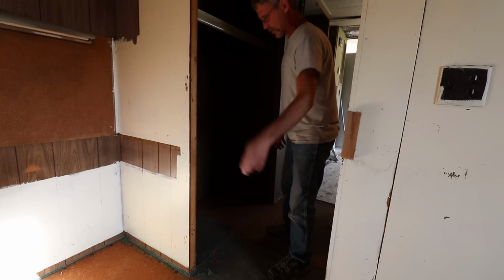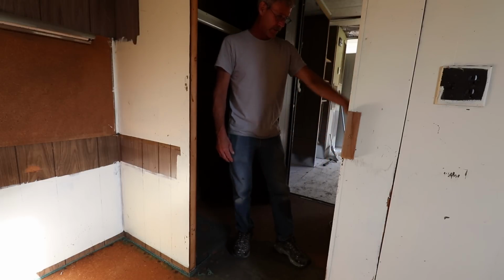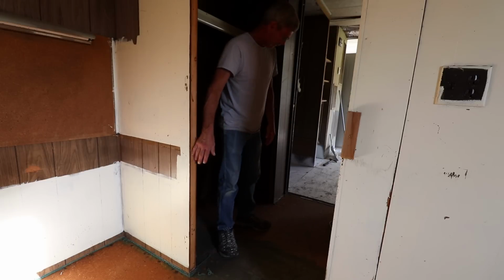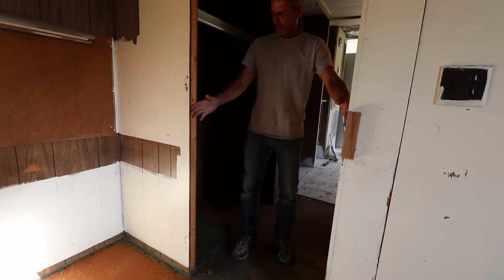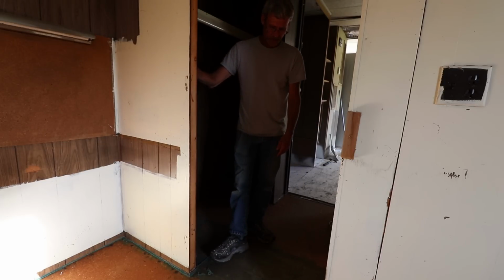And then this would be the closet for the bedroom, even though since this is going to be laundry, I'm going to put the door. Where am I going to put the door? On this side I can put it here or over here, but I think this is a better bet because I can get this to a 2/6 door. I'll probably have to widen this out a little bit, but these 2-foot doors that they had in here, I just don't like it, so I'll probably make this one a little bit wider.